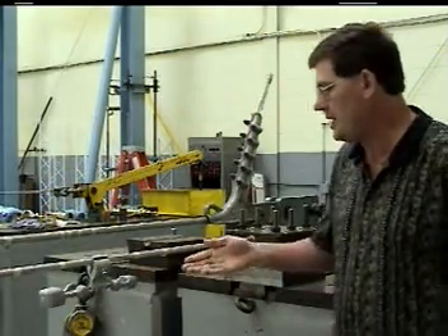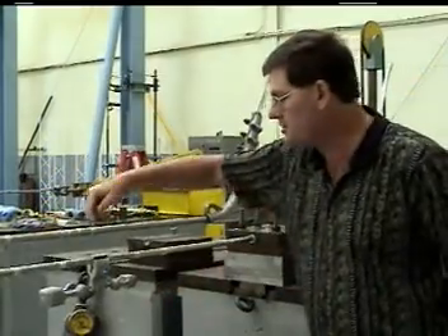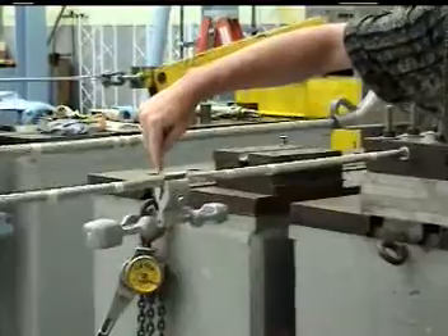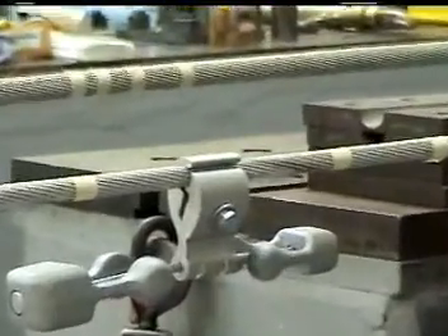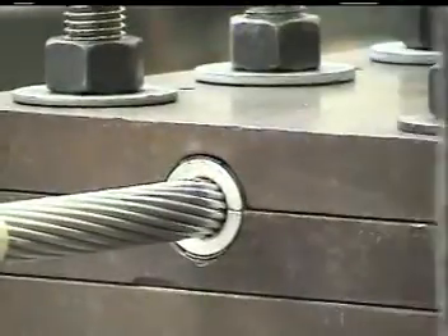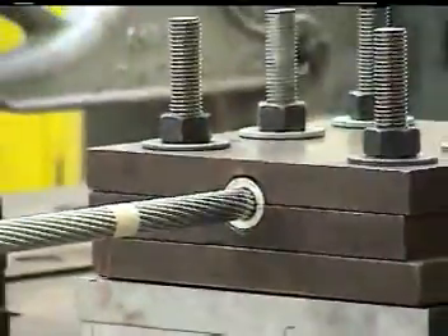For this particular setup, this is being done in accordance with the IEC standard. We are required to mount a device called a strain gauge at the locations of the damper clamp and also at our rigid clamp attachment. This is not required per the Australian standard AS 1154, but it is required for the IEC standard.